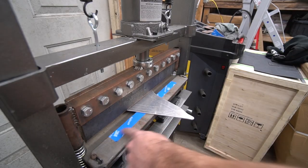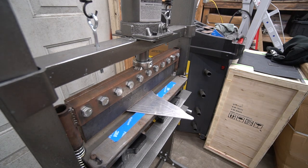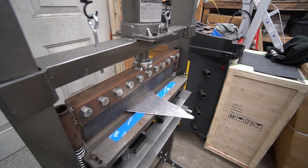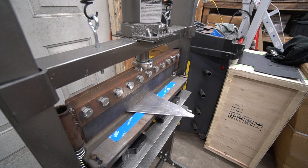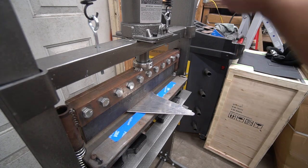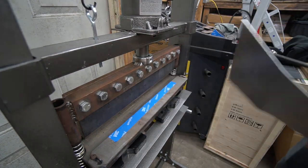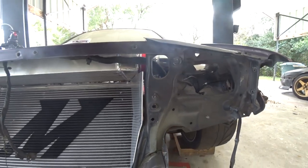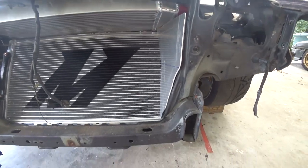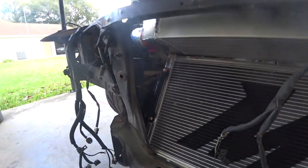All right, we've got our lower dies adjusted out to give us kind of a wider radius. We're gonna just put a light bend in it. All right, well, that is the main shape of one side done and dusted. We'll modify our CAD template a little bit to match this side more perfectly. Cut it, bend it, see how it looks.